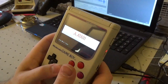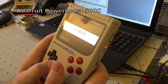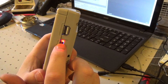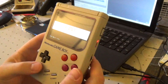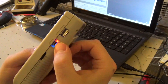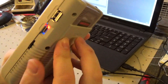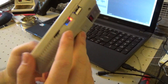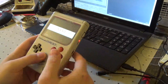The charge controller I'm using is an Adafruit PowerBoost 500C. I've rerouted the low battery LED so this red light means the battery is getting low. There is a micro-USB port here for charging, so you can use basically any 5-volt phone charger. There's also a USB port you can use for just about anything — you can even plug in another controller.